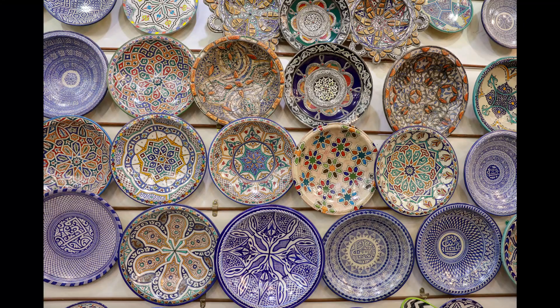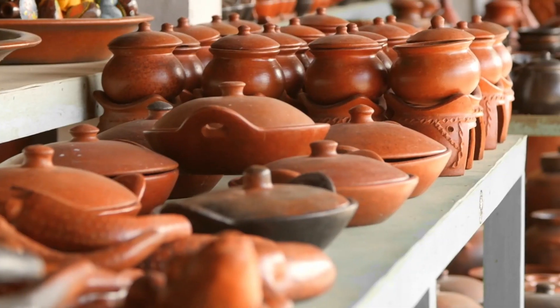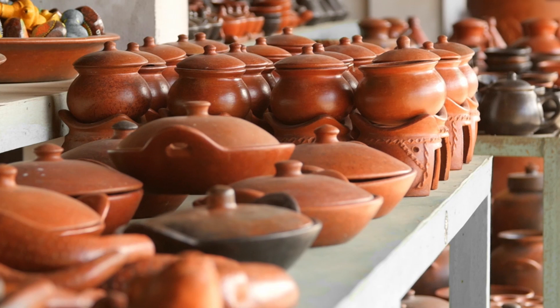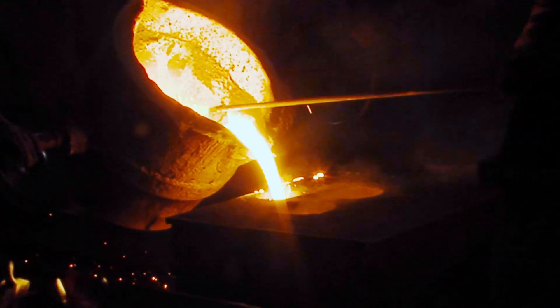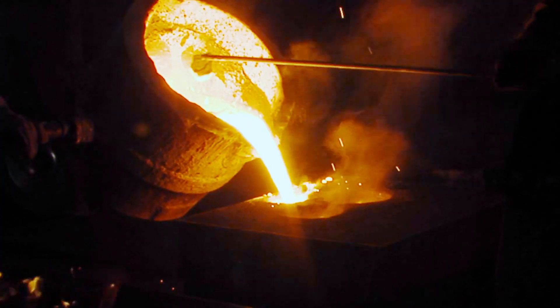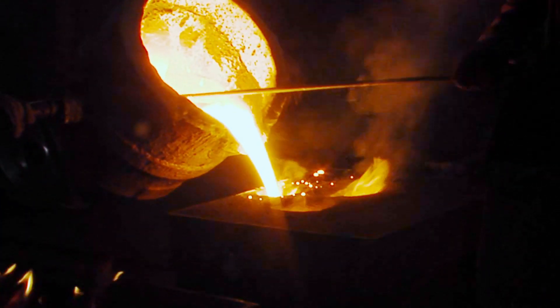So what is a pottery glaze exactly, and what is it good for? As far as I can tell, it's basically good for two things: one is decoration and the other is protection, and as you can probably guess in my case, protection is the real priority here. A glaze fuses a thin glass-like veneer to the pottery surface — it smooths it, it waterproofs it, and generally protects it. And for a crucible, hopefully what this is going to do is keep molten metal from bonding to the clay and making a big mess.